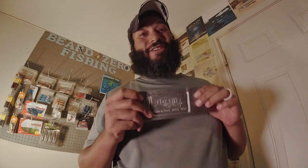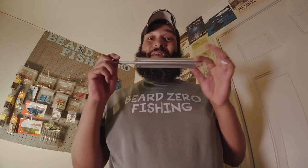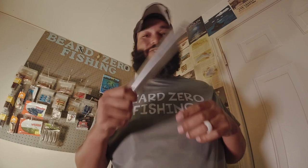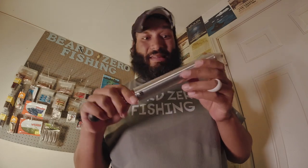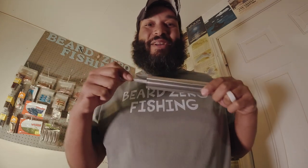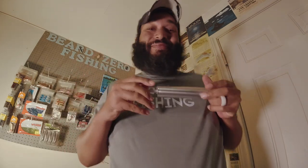If you're trying to do production molding, stay away from these — they aren't what you want. But for my purposes here on the channel, these are going to serve very nicely. I would say stay away from the injectors from Do-It molds — they're super, super lightweight, and mine came dented, so it's almost impossible for me to use without it seizing up on me. You win some, you lose some. That is my opinion on the Do-It products we went over in this video.